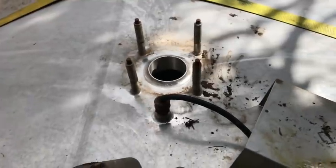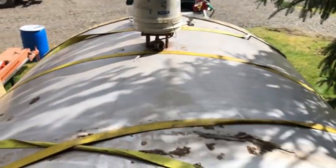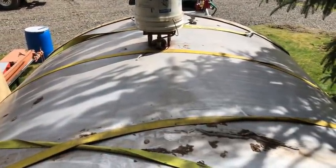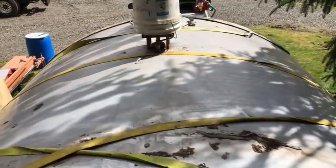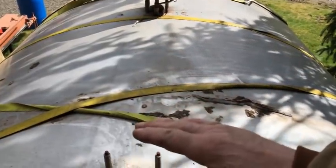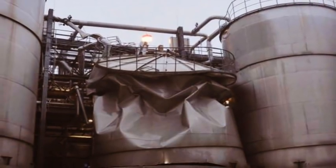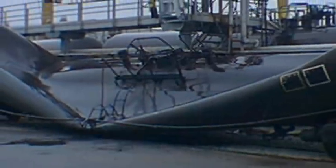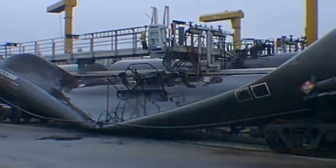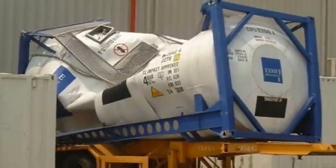As with all tanks, you need to have them vented. If you don't have the tank vented, let's say the tank was full of water and you had a main break or high usage, the fluid out of the tank would start to escape and it would cause a vacuum. The tank, under enough pressure, would collapse on itself. You may have seen YouTube videos of tanker trucks that didn't open their vent — they actually implode. I've actually seen a tank in real life that had been subject to non-ventilation, and it collapsed — basically crushed like a soda can.